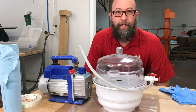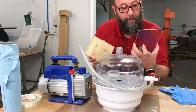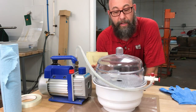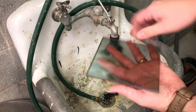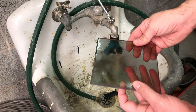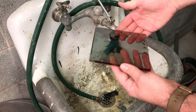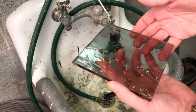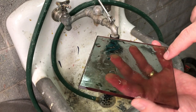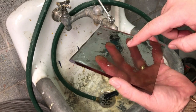While our Hextel is degassing, it's a great time to clean our glass. I've got a piece of lead crystal and a piece of didymium glass to bond together. The easiest way to see if your glass is clean enough is to get it wet with water. You'll see it beads up like the surface of a waxed car — it's not sheeting nicely. If pieces bead up like this, you're almost guaranteed to have a problem with your bond joint. You need to clean this glass; there's something interrupting the Hextel.